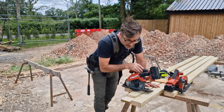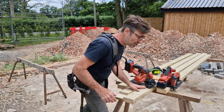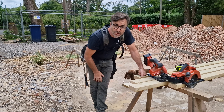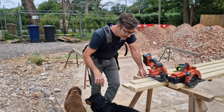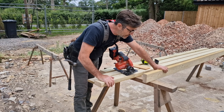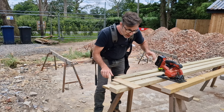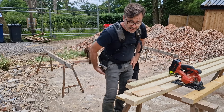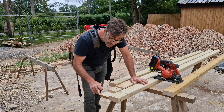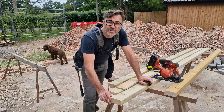This is how I like to do the halvings. What I don't do is put lots of repeat cuts across, then smash it, make a load of dust and have to do a lot of chiseling — it just takes too long. All we need is a circular saw. I will caveat this: if you're a professional, have a go; if not, make sure the work is well held and well clamped. When we do the cuts I'm ripping with the material standing up, so it might be prudent to clamp it. A little trick — this piece of ply represents the thickness of the timber with an extra millimetre added, so all joints are exactly the same length and work at right angles. I've had to cut about 30 joints and human error means one will be tight if you measure each time.